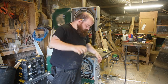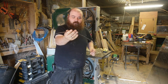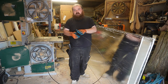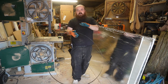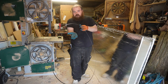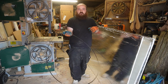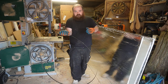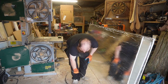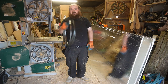That's the blade out. Now it's time to wrap it up. For this next part, you definitely want to wear gloves. I have my foot on it at the bottom with the teeth facing away. You turn it towards yourself while pushing down, do a full rotation, and you end up with a coiled bandsaw blade — tied up and ready to dispose of.